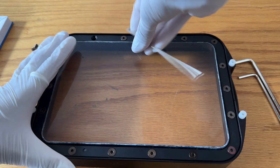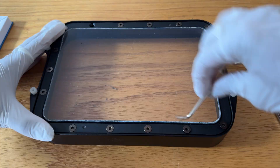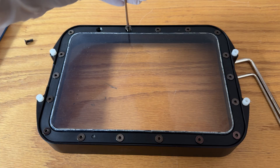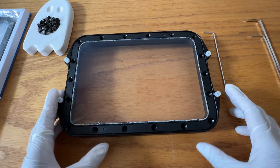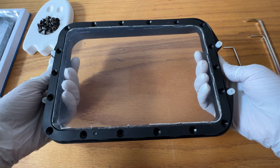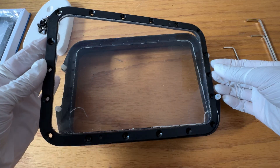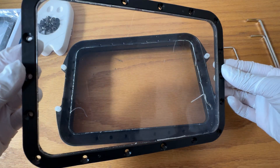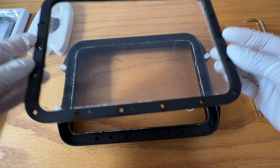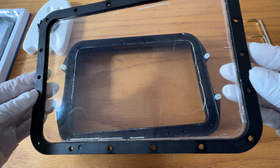As you're removing the bolts, I would just keep a note of how much tension there is, so you can put the same amount of tension back in once it's time to swap in the new one. Now once you have all the screws removed, you can push from the back and it literally just pops out — there's really no way to mess this up. That's why this kit is a little bit more pricey, because there's only one way that the frame can fit back into the vat, where the holes have a little divot so that the screws can sit flush.